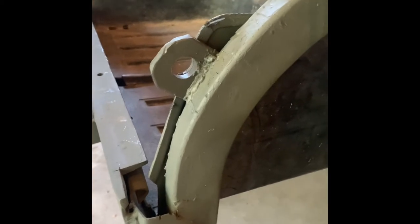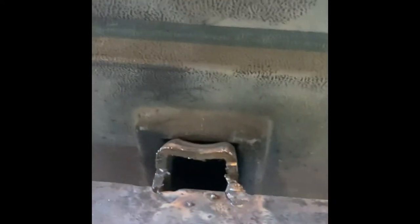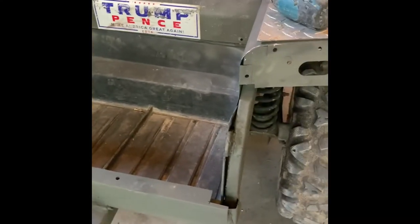And I remounted the hinge on the bottom of the box just to push this bracket as far to the frame as we could, and I got it as close as I could get it. Came out really nice. It dumps extremely easy. But that's the only modification, with the exception where I notched that bar and we just welded a piece of angle to it to hold up the one side. So I'm gonna park this thing outside and we'll put it together.